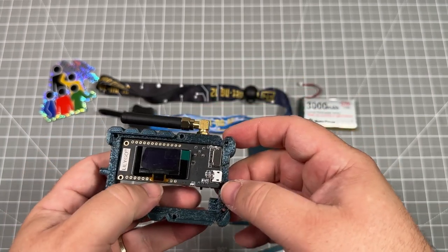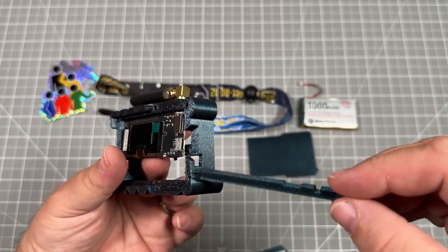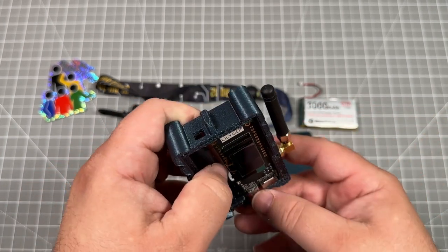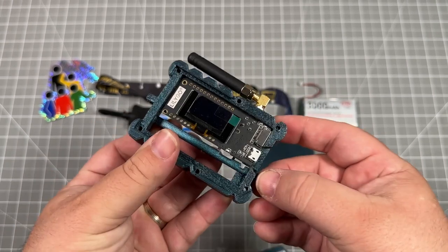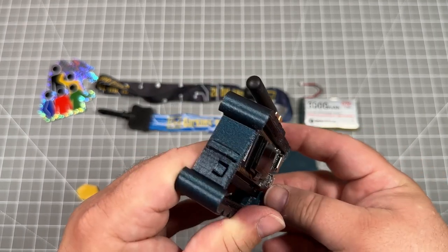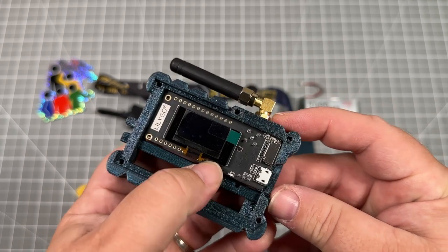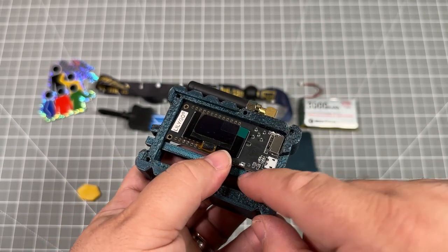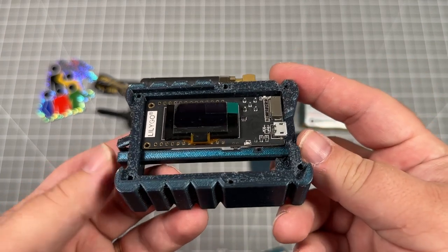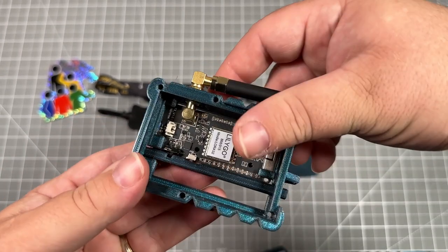After the antenna's been attached, you can see it's still a little loose in the body. We're going to put in what we're calling the power bar — slide it in here, lifting the board a little so the switch is sitting above the power bar. We slide this through the entire body and out through the other side through the hole, making sure the on/off switch is in that groove. We've also made sure there's clearance for the reset button not to be touching. So with that, we've installed the board and the power bar. Now let's flip it to the back.